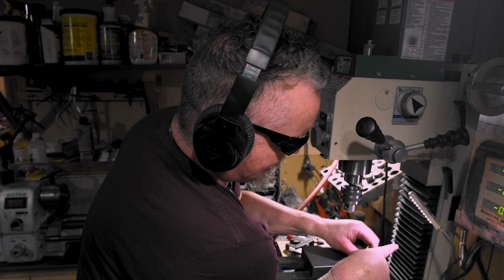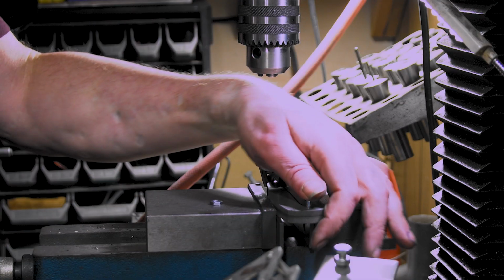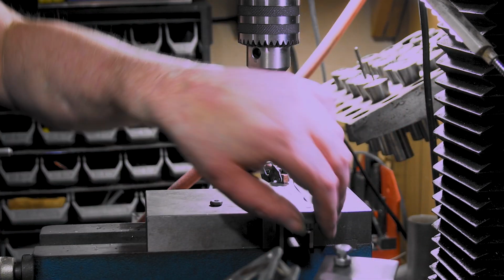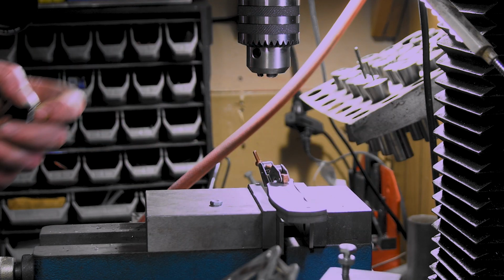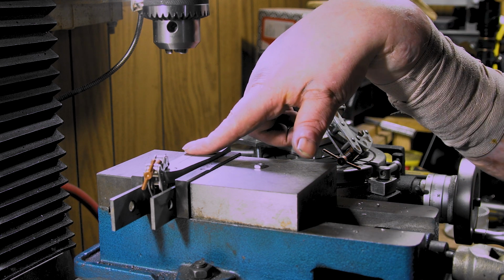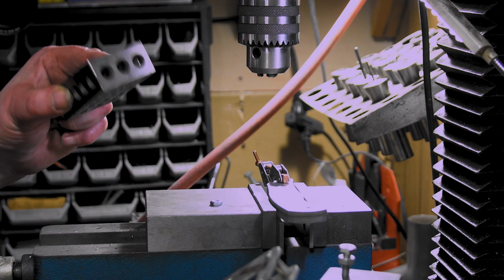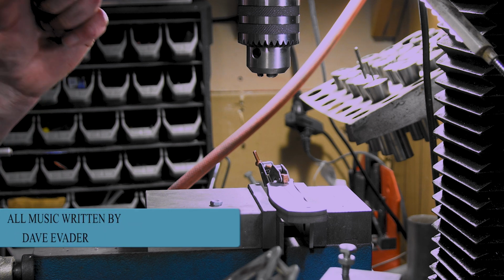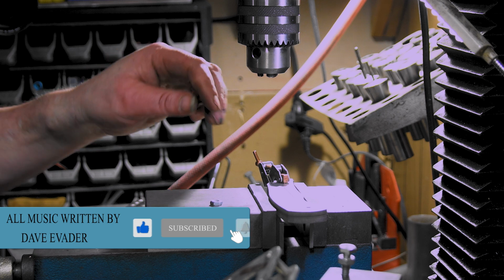Let's just get right to it. I got this locked in here. So let's just take this 3/16 out. See, I figure this way, even if I'm a little off with the 1/4 inch, at least it'll be lined up together and it'll all be flushed together. So I tapped it in with the mallet and these parallels. See, I usually put it on 1, 2, 3 blocks, and I think that's where I'm having problems, because something seems to be off. So I'm just gonna do it straight on the parallels, and hopefully that'll work out.